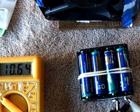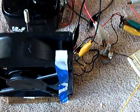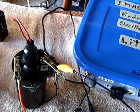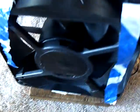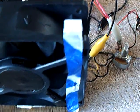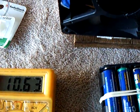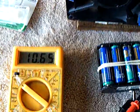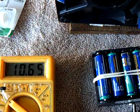Right now the oscillator is running and it's not making any noise, but the fan has been turned off and the light is on. The oscillator is still doing its thing — there's the ignition coil, the drive battery, and then the Bedini circuit inside that fan. It's a standard Bedini circuit, a little different from the circuit diagram, but it's charging up this battery. If I turn the light off I get much better charging because it's not pulling a load — it all goes into the charging, which is really neat. But I want to show you the mess this made.